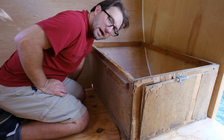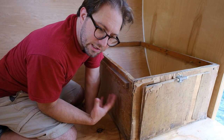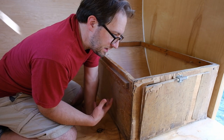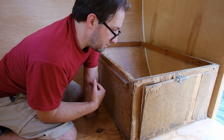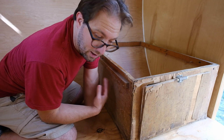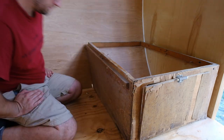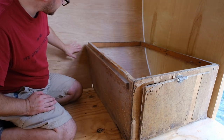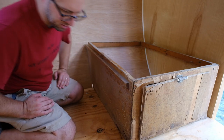So, you know, I didn't keep every single piece of cabinetry that I pulled out of here. I just kept a few select pieces to help me in reassembling. I will be patterning the front banquette off of these. So this is very similar to what's going back. I'm actually pretty tickled. I got this curve really close. But yeah, I'm going to take some measurements and I'm going to put my joist right about here. I think that's the smart thing to do anyway.